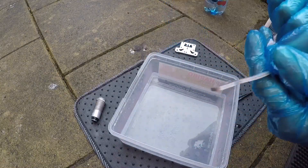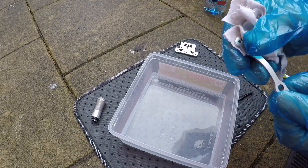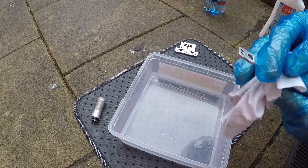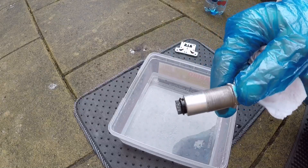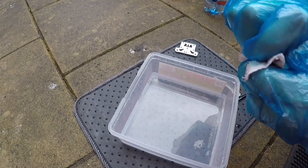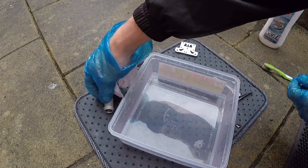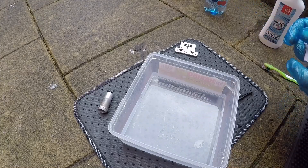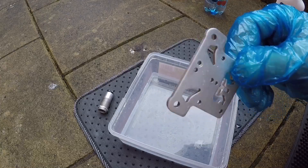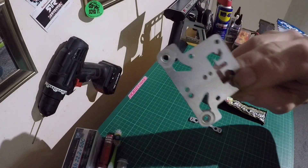Give them a wipe — look at that, perfectly de-anodized, and it'll come up really shiny with some polish. You can leave it like that if you want, or you can polish it and then use lacquer on top to keep it shiny. That shock I showed you earlier is two years old and you can still get some shininess to it with a rub — aluminium doesn't tend to rust or pit too bad.